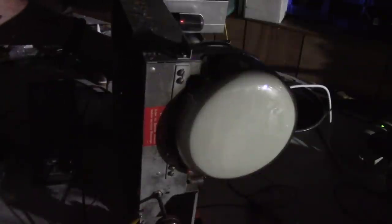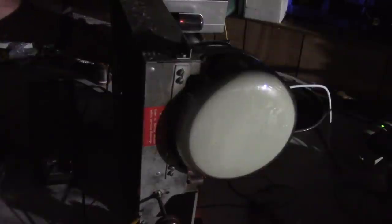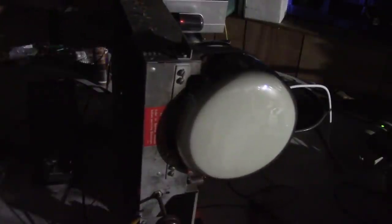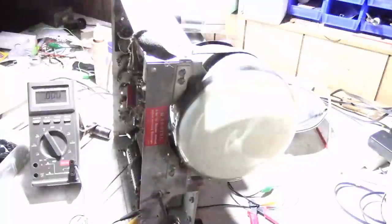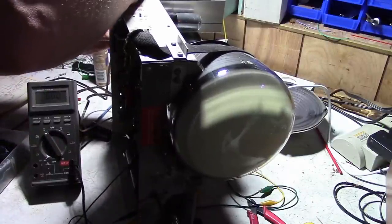Yeah, there's going to be focus and centering and linearity and stuff. It's not really going to make or break a picture. Kind of weird squealing changes when I turn that control. It's probably a horizontal hold or something. Oh, wow, that control is completely frozen. So, frozen control, that would be vertical centering. I'll have to work on that.